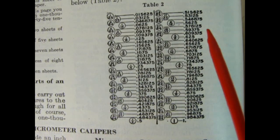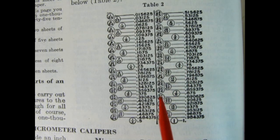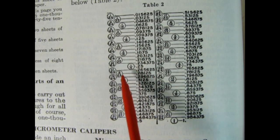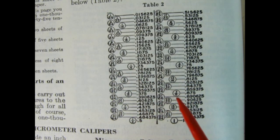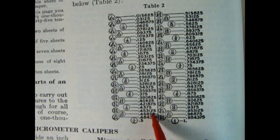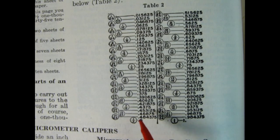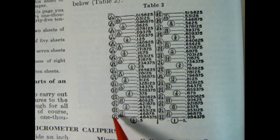Another great thing in this book is a conversion chart showing the decimal tables, and this goes up into 30 seconds, I believe. So when you're scaling things down in 1/25th scale from the actual article, and you're using a calculator and you come up into these weird decimal places, you can actually see what the measurements would be in inches. So for example, 0.25 is a quarter inch. Well, we know that. But what if a number like this comes up? 0.453125. Well, what the heck is that, right? So you just go across and it looks like 29/64. Oh, it goes into 64, so that's even smaller. So these charts are invaluable because when you're scaling things down, these will give you the exact measurements.